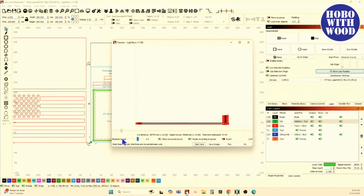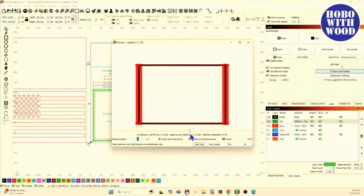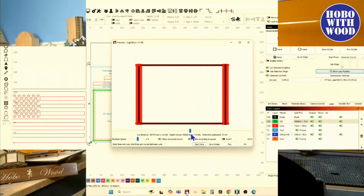And if we look at the preview of how it engraves this, it does everything across that bottom on the X. Then it starts up that Y, does that complete Y, and then it starts. Well, it didn't finish it though. Goes there, and then it finishes there. Now, the reason that's so much faster: you had where they were talking about splitting it up to where you did 2 X's and 2 Y's. Well, here Lightburn split it up the same way they were talking about doing it, but it continued to scan everything on the X.